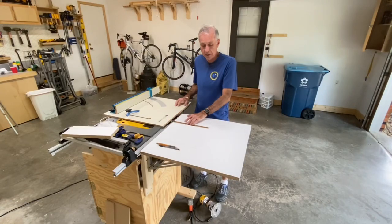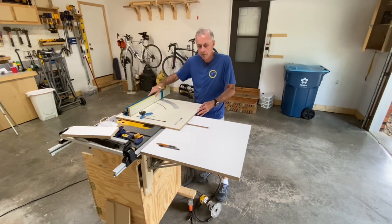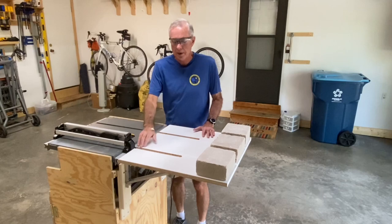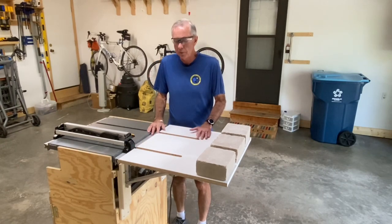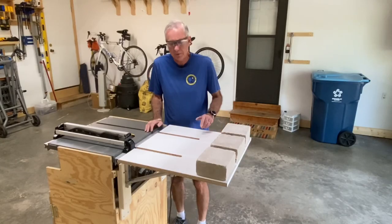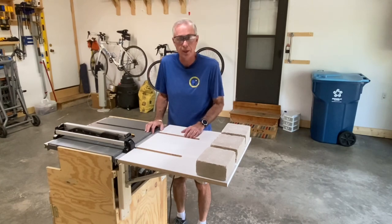Our channel came out very neatly cut because of that jig, and now our crosscut sled will slide up as far as it needs to. I'm going to go ahead and do this second channel while I've got my router out and then move forward with the next step. After completing routing both channels in the outfeed table I put a chamfer bit on the router — just a beveled bit — and went around the outside to bevel off all the sharp edges. If you don't have a router for that you could just use sandpaper, but the router is pretty critical for putting these channels in.